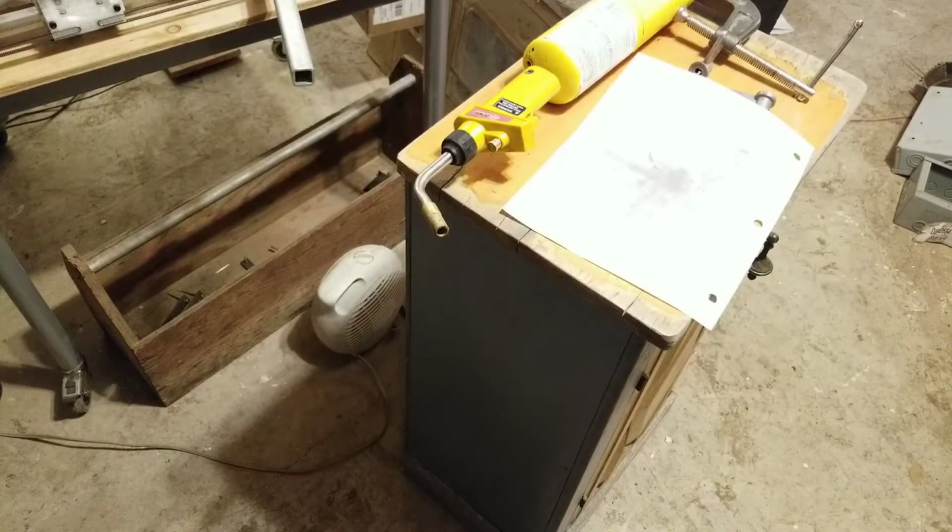So there were some other trace elements in there that we could see, but that was primarily a red-orange flame. So I believe that this is an aluminum alloy and it should anodize. So I'm going to get the anodizing bath and power supply set up, and then we'll give that a try and see what happens.